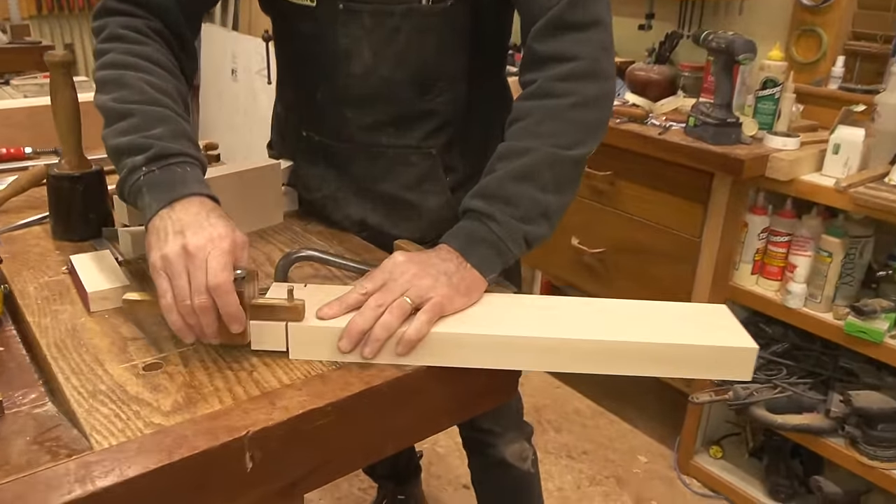I'm just going to go about halfway each side here and slide to the left so that the chips don't hit me. I'll go right across here, take out that little nub, and just clean everything into plane with those shoulders — that's what we're going for. That side's good. Let's flip and get that center right there.